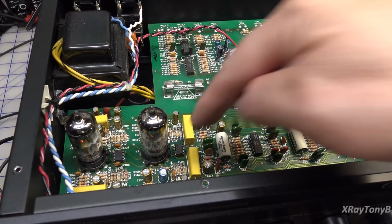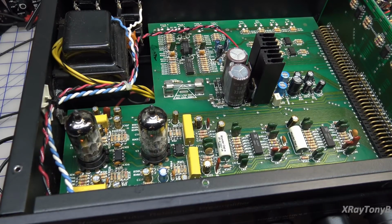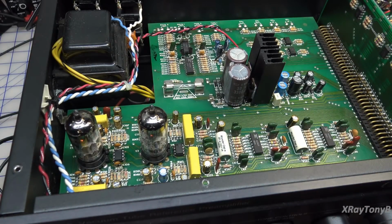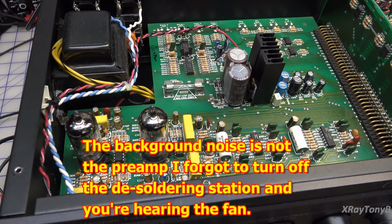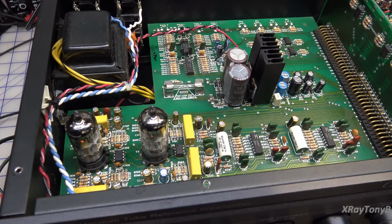Well, there was nothing left. It had to be those two chips, so I removed them and put a couple of brand new TL072s, just like what was in there, and very disrespectfully and unceremoniously clipped them out. These boards are extremely hard to solder on. They're those kinds that if you're not really careful, you'll break the tracks right off. But anyway, it's working now, and it works perfect now. So I think that's all it was, and that was a weird problem. And I think actually that it was this one here, this U11, that was the bad one, but I did replace both of them.